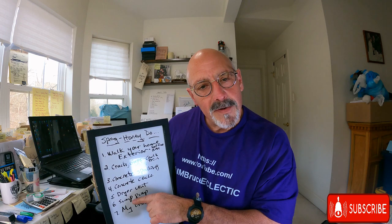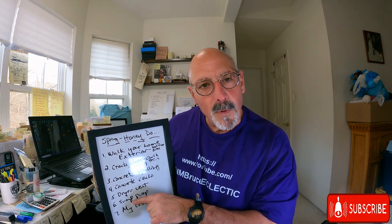Or if you're on public water, you can get a public water backup system. So you need a licensed plumber to do that, and the plumber will tap into the city water lines, and there's a little machine that goes around the sump pump. So when the power goes off, the public water creates a vacuum, I guess a venturi. Anyway, it makes the sump pump work. So if your sump pump goes off when it rains, get a backup, whether it's a battery or a public water backup system.